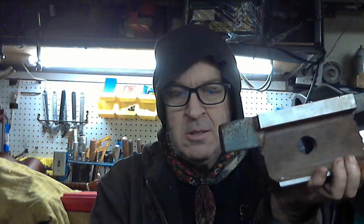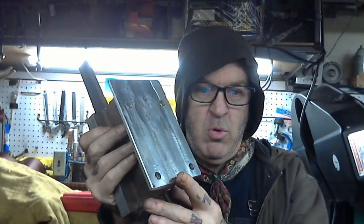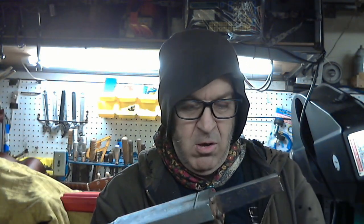Okay, not bad for a day's worth of progress. This will just be a part two because I have some more operations to do down here. But I did get the mounting holes set in, which was one of my goals today, and got the bottom plate faced and end milled on the edge. So it's square now. And I'm not going to put you down because every time I do, you fall on something I care about. But there's some deburring to be done and some flat spots that need to be put in